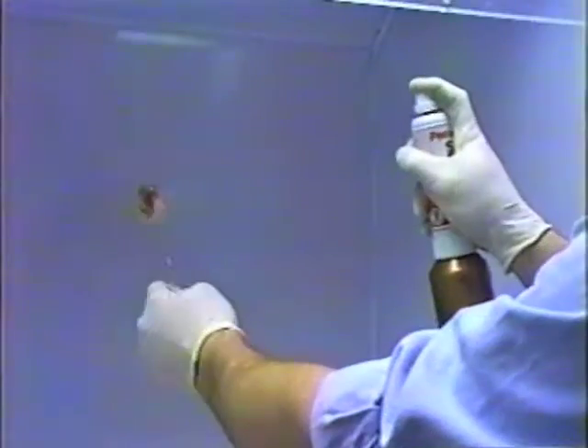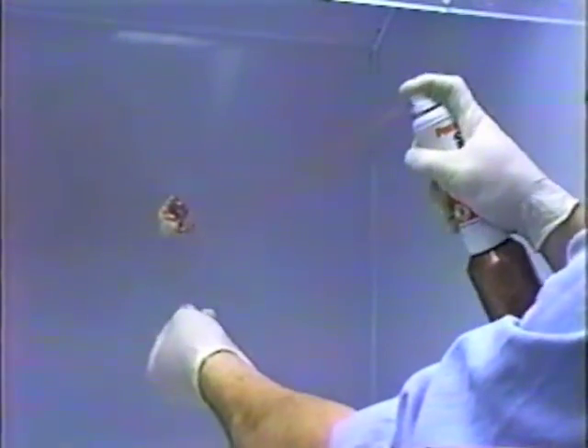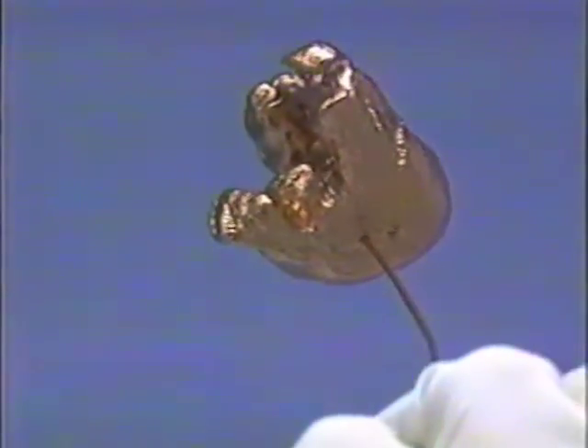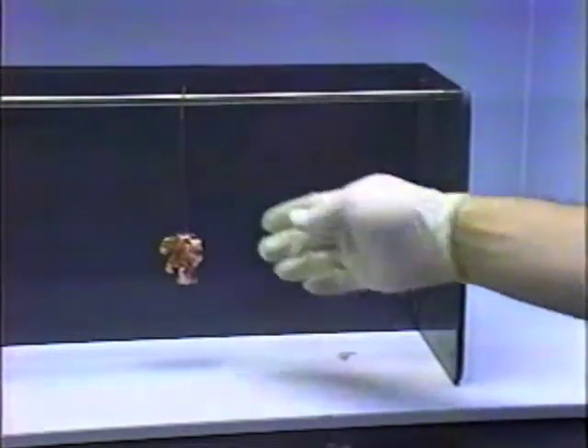It may take a few seconds for the paint to start coming out. Spray with a steady back and forth motion across the part, making sure all areas are evenly coated. Make sure to spray the base of the plating wire to maintain continuity. Using the plating wire as a hanger, hang the part to dry for five minutes in a dust-free area before spraying on a second coat.